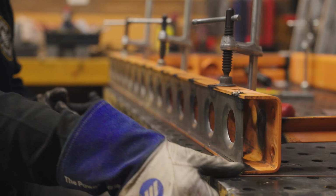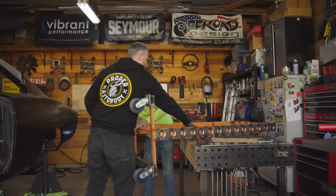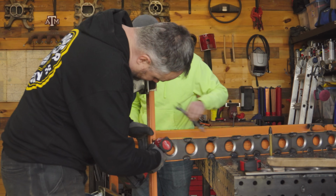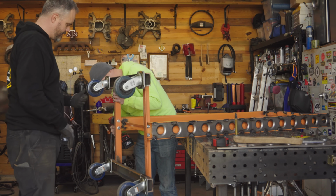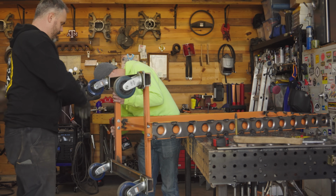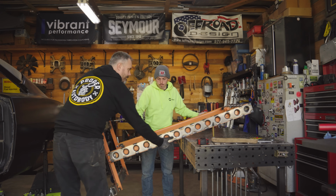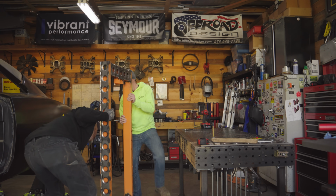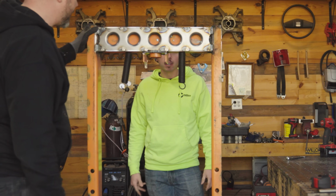Now, a little detail. You'll notice I'm spacing out my welds. That serves a few purposes. Fewer welds take less time and consumables, sure, but it also means less heat input to the work, which helps keep everything from bending into a taco shell. So that's helpful. Also, if one weld cracks from stress because of the gap between them, that crack won't immediately propagate across the plate.